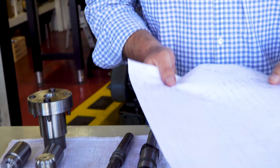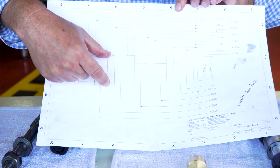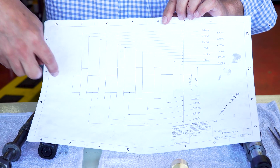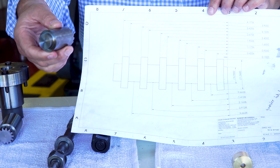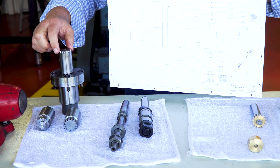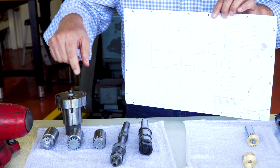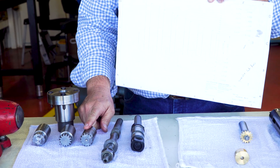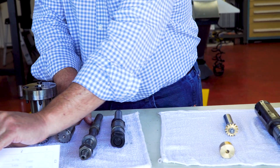Now these are a part of the tree. What happens is we design lots of gear blanks in a row and we cut them all on the lathe as one long piece. This is the leftover piece that was in our adapter — we hobbed all the way down here and nipped that last piece. Sacrificial arbor, really, is what that ends up being. It's a little bit wasteful of material, but sometimes when you're making low counts, it's the way to go.